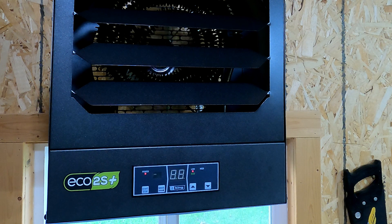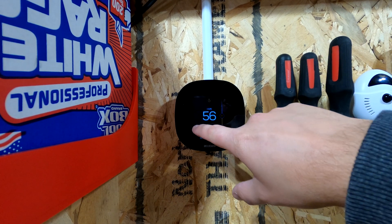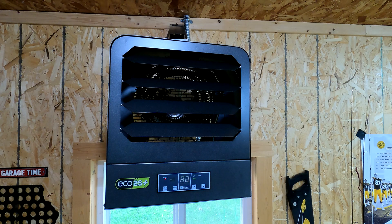You can do one of two things: you can go into your phone and cancel it, set it back to 56 degrees, or you can hit the little X and it's going to fall back to 45 degrees where you had it — resuming your schedule and turning the heater off. It'll run for a couple more minutes and you'll see the power button blinking on the left. At this point it's dissipating all the heat out of the element and the fins, trying to utilize as much as possible and help add prolonged life to the unit. When it's done, it'll finish its cycle and shut off, waiting for the next call from the thermostat.